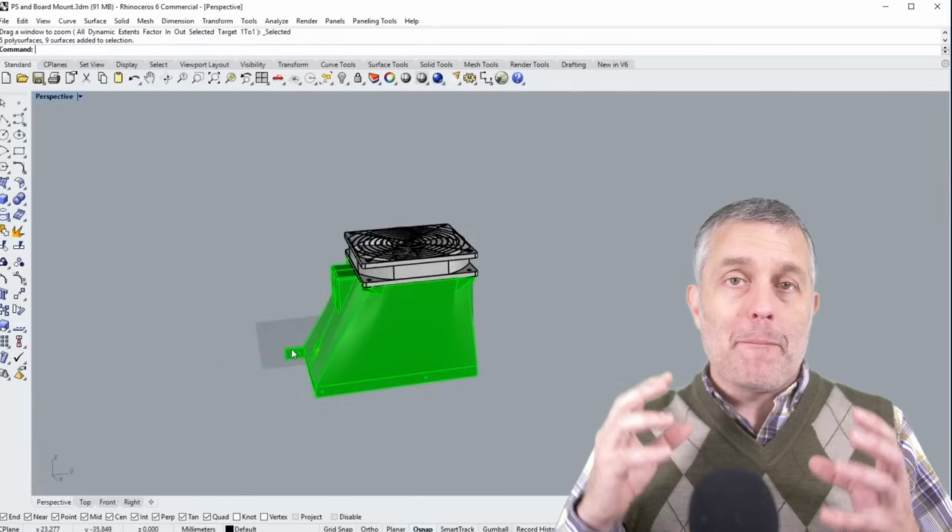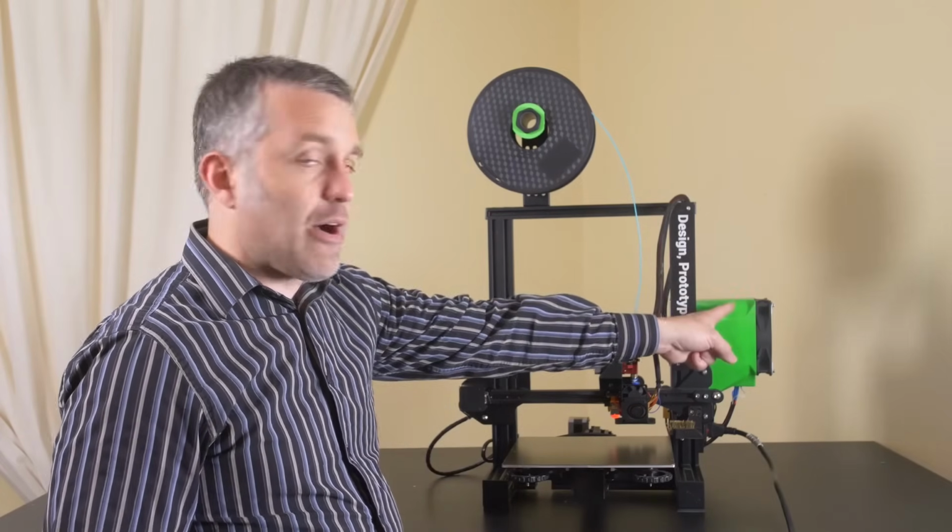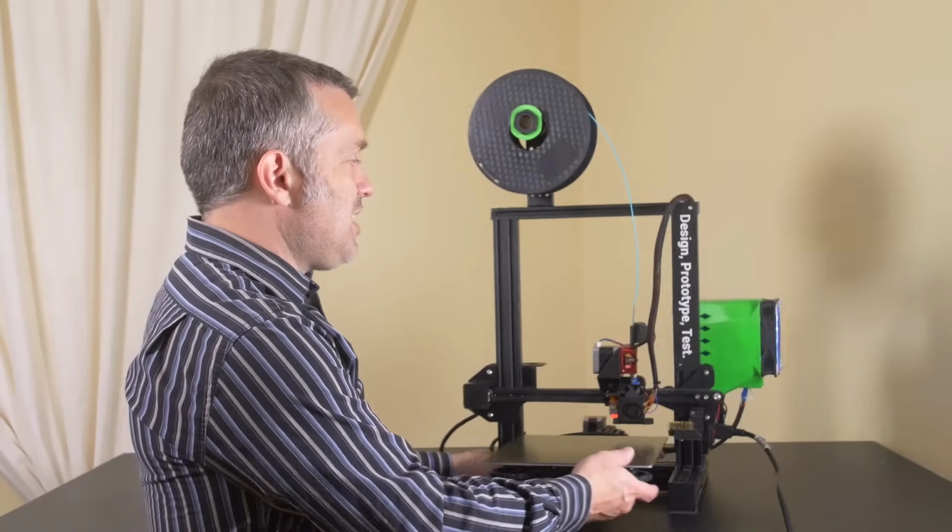And the fifth thing that I would do is my combined cooling tower. So there's a video about this one in the description as well. And basically I move the location of the control board to a place where I can use a 120 millimeter fan to cool both the control board as well as the power supply. So we're getting rid of two very loud, small fans that don't move as much air. So we're getting better air supply and quieter printing. So it's kind of an advantageous thing, but it is a bit of effort, so check out the video for that one.